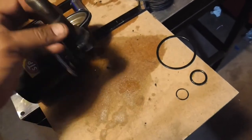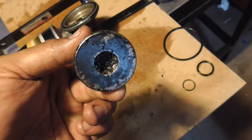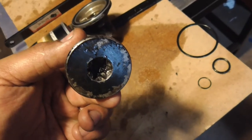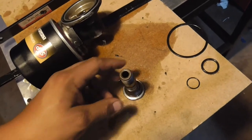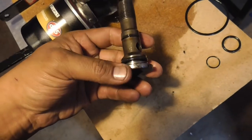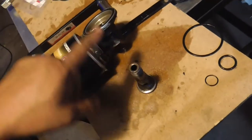On this, you have to pull it out of there. This is actually a T60. There's wrong information out there on YouTube that it's a T55. You can use a T55 to get it started to loosen it, and you can even use a pair of channel locks — bigger ones — on the top side to just work it loose, as it spins inside there.